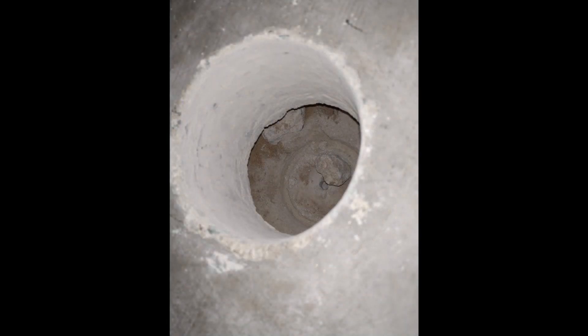Since I'd already drilled the hole I decided to leave it and just dig it out as best I could. My recommendation: use a smaller bit and drill pilot holes in multiple locations to confirm you won't hit anything before committing to the full hole. Please do that.